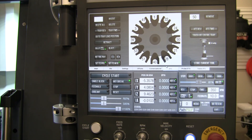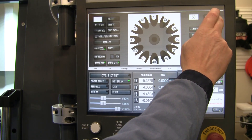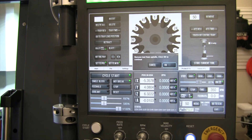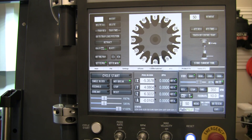Now I decided it was time to correct tool number 50's position — it was showing in the ATC but was actually in the spindle. In my infinite wisdom I hit the 'Remove' button on the ATC, thinking I'd get a pop-up asking whether to fetch it from the tool changer. What actually happened — you can maybe see it in the corner — is my Tormach tried to fetch tool number 50 when it was already in the spindle. Needless to say, there was a crash and some choice words off camera. Thankfully there's a lot of flex in that tool changer and the only real damage seems to be to my pride.